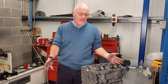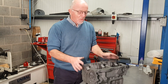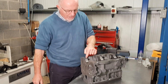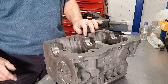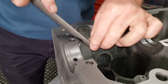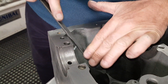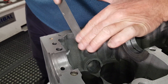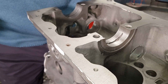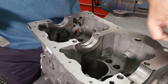We've fetched the block back around now from being topped and tailed. We're going to give it a general cleanup to get rid of any stress raisers. First thing we do is go around all the edges with a smooth file to get rid of any sharp edges. You're best off to use a half-round file — it'll run into all the radiuses. Just a nice smooth corner break. We're going to go all the way around on the inside on all four sides and then all around the outside.